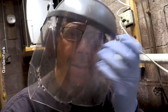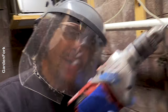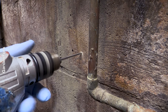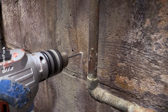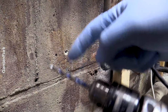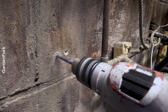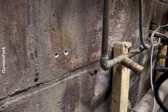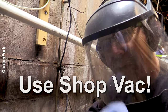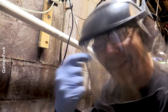First, the lag bolt. Eye protection and ear protection are a must. This drill makes a lot of noise and it'll throw out cement, so be careful. Use a bigger drill bit for the lead anchor. There is a lot of dust when drilling cement — put your shop vac or a vacuum right underneath it to suck all the dust out. If you're doing this in someone's living room, put a vacuum underneath it, then drill.